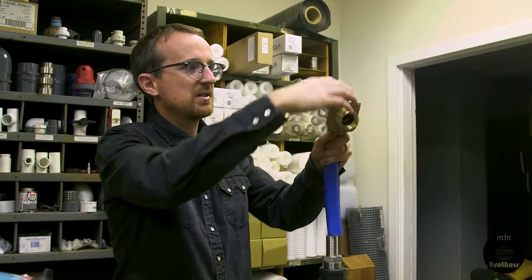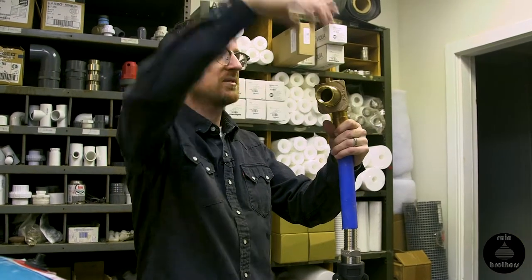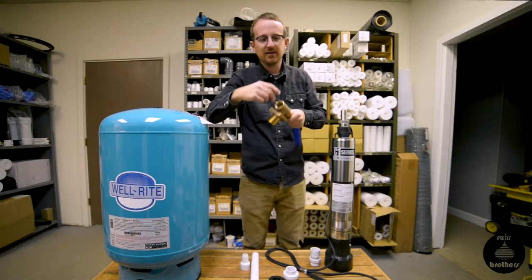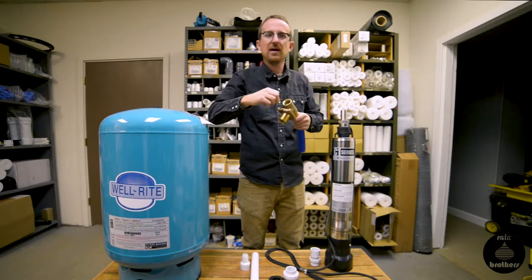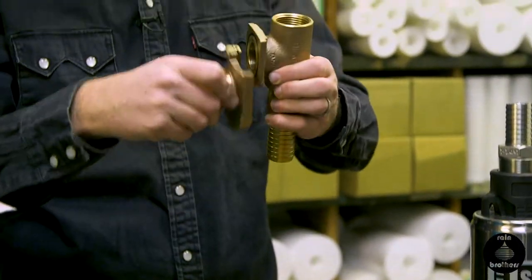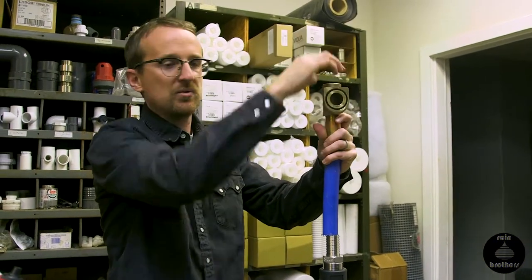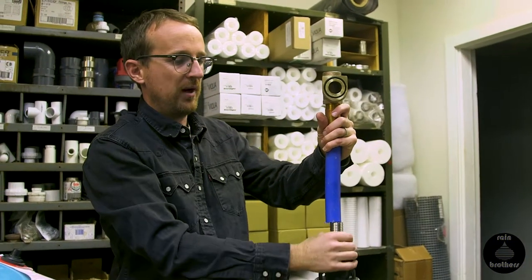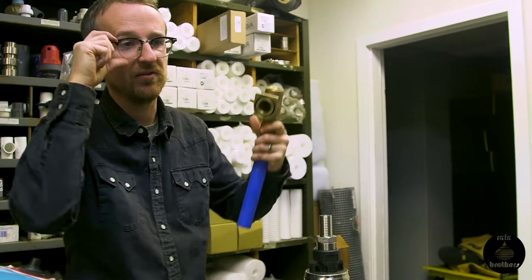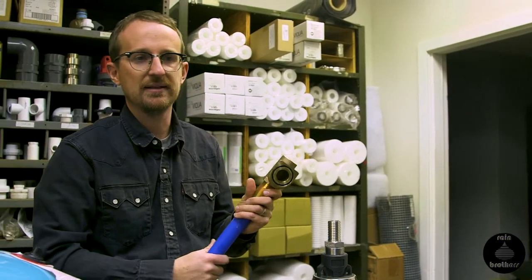The way this works: the blank side on top — from outside the tank, we'd stick a one-inch threaded rod down into the tank and thread it into the top of here. With that rod, we can pull up and separate this fitting — it just slides right up. The pump is still plumbed up. With the one-inch rod connected, we're able to pull the whole pump, pipe, and pitless assembly out of the tank to either switch it out if it went bad or to maintain it.